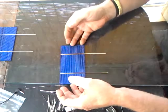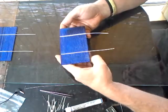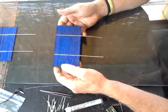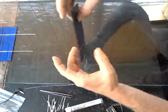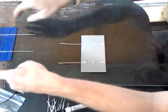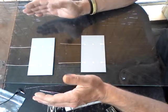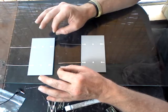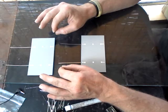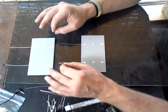These cells are being put together in a panel of 28 cells. Each cell is 1.8 watts and one half volt. When you start joining the cells together in series — basically like stacking batteries in a flashlight — it increases the voltage and the wattage. Mathematically, 28 cells at 1.8 watts gives approximately 52 watts of power at 14 volts. Amperage will also increase when we set cells in parallel, and we'll get to that a bit later.